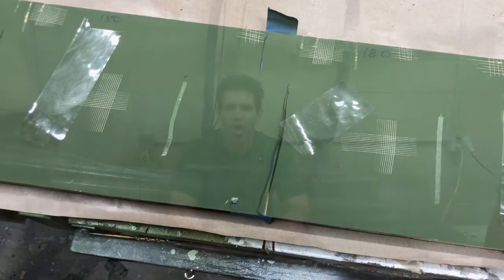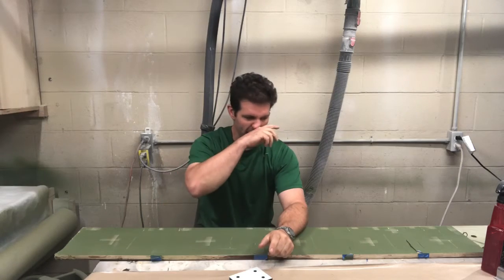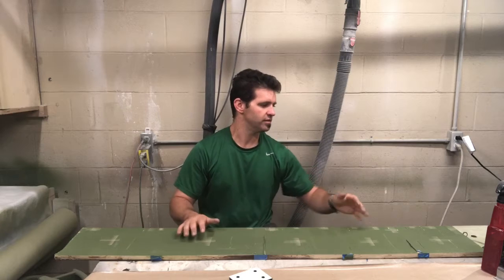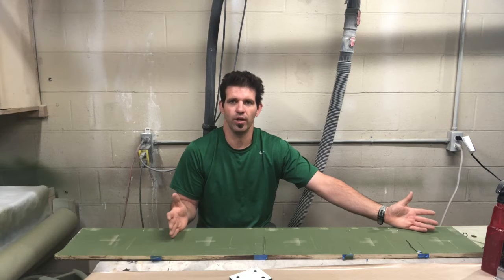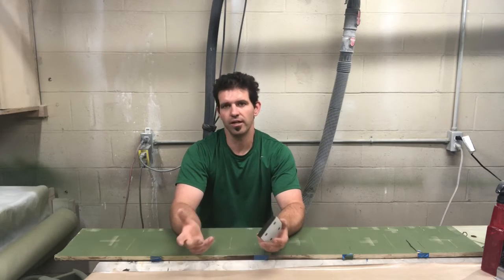Let me give you my final thoughts. I think this is a good reminder to all of us of how important mechanical bond is. I should have done one without sanding, but I've done that in other videos and you can see some products do better than others without sanding. But the truth is you're always going to get a better bond with a mechanical scratch or if you're going into bare wood. I was a little surprised that the deglosser did as well as it did, but over time it's just not going to hold up to the abuse of a mechanical scratch. So what I tend to do is, the glossier the surface, I'll go down in grits because it doesn't load up as easily.